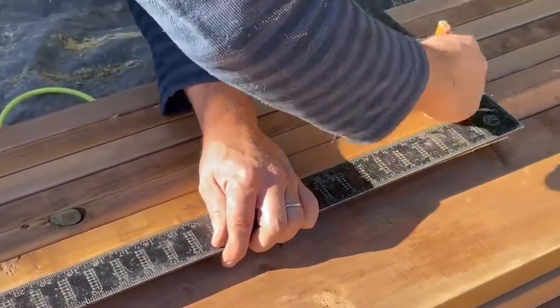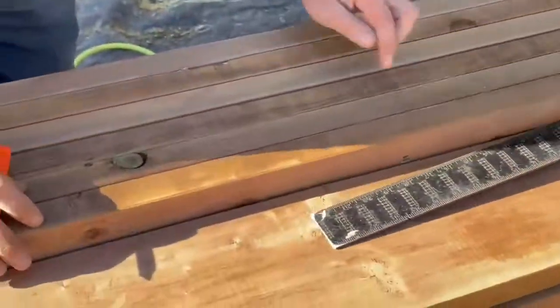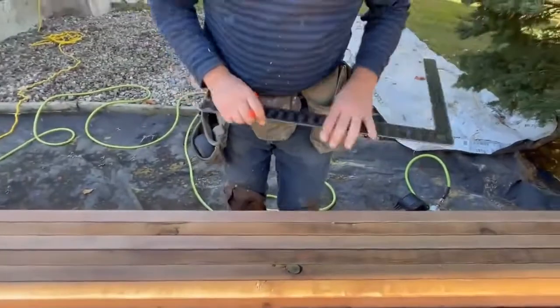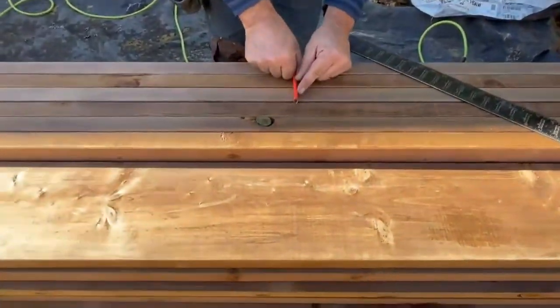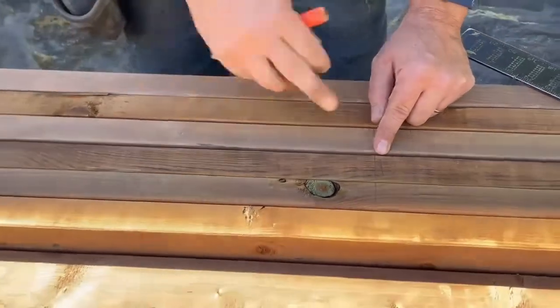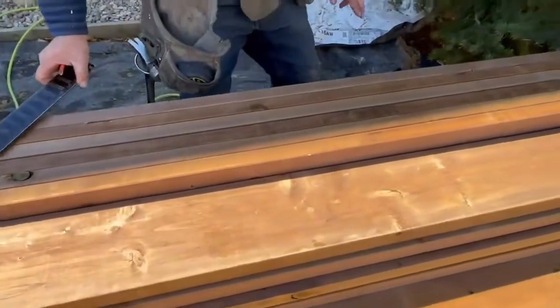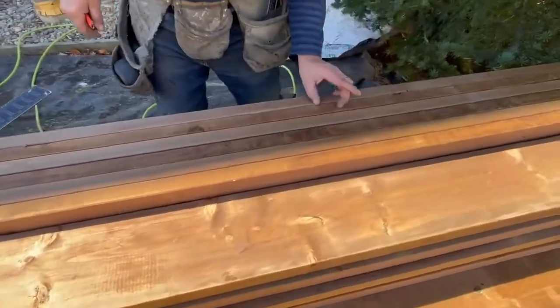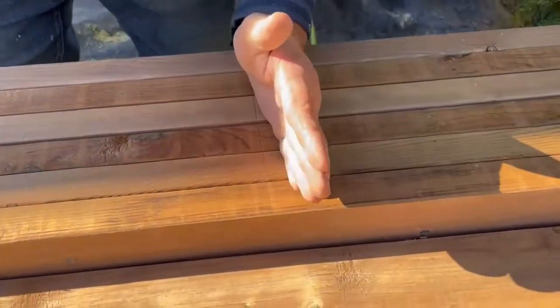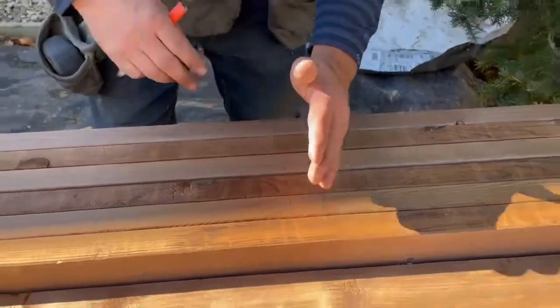You may notice, if you look really close over here, using your framing square is not quite as accurate — I'm actually drifting just about a quarter inch there. But if you actually lay out your tape and mark it, which I had done here, you notice I already have a joist laid out here. That's because there's a jog in the wall and I want to make sure my joist is deadly straight there, so I laid that out first.